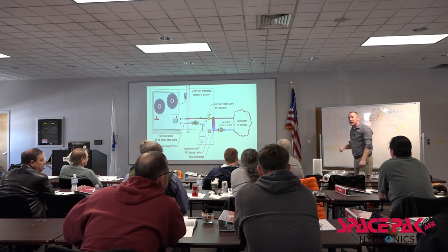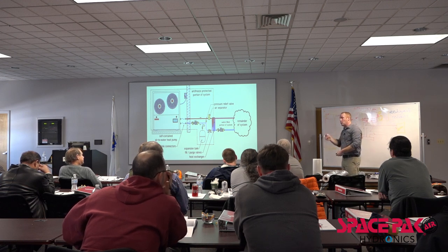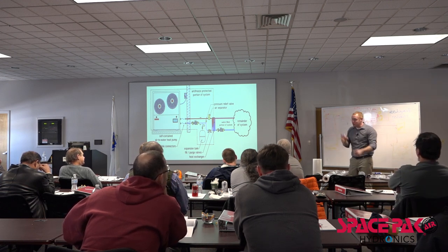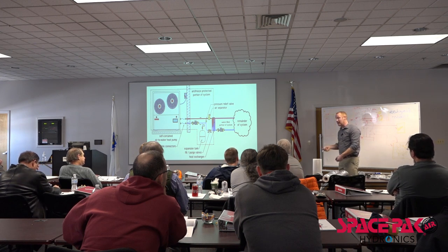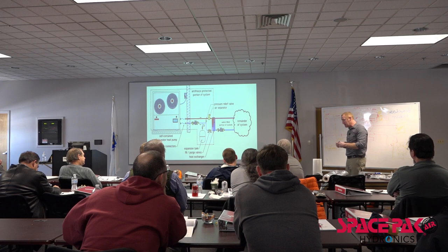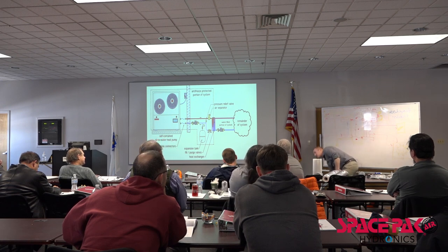Absolutely. Yeah, and when you're already dealing with low water temperature, you start taking degrees away from that, you have to allow for that. And again, if it's sized correctly, that 5, that 6 degrees you may lose could be the difference between that house reaching set point or not. So it's just something to be very mindful of.